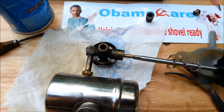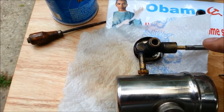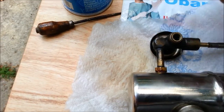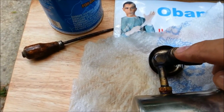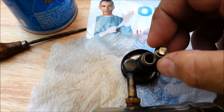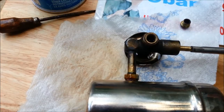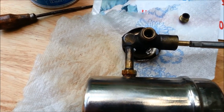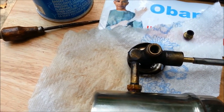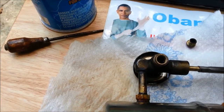I've done a little more work on it. As it turns out, there's a timing issue here. The stem has a set of threads on it that move it in and out, and it opens and closes a seat that's apparently machined in here. Our little block with the wire pin on it that rises and falls through this hole — that little block has gear teeth on it and it rides up and down. So as the stem is turning, it's moving in and out and moving the shaft up and down. If you install this incorrectly, then you can't lower the block far enough because you've seated out the valve.